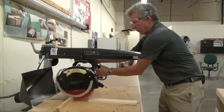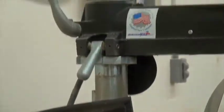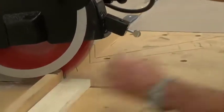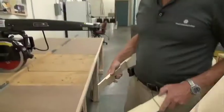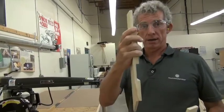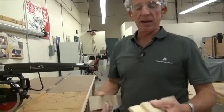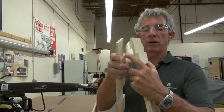I'm going to set my blade, coming halfway — no more than halfway. What I have is a big rabbet and a big dado and those go together. Here is your lap and here's a lap — those are the end laps. Setting up basically what they are: they are like big rabbets. This piece's thickness fits right here, this thickness fits over here.